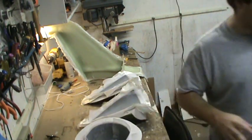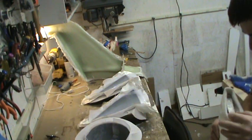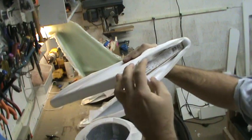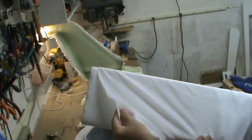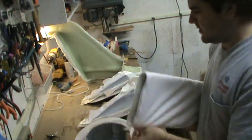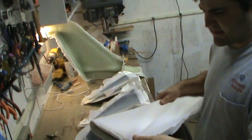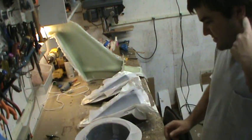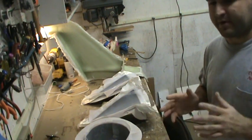This isn't really peel-ply — for those who haven't seen my fiberglass technique, it's just 100% polyester dress lining and it's static free. It's like a dollar a yard at Walmart or Joann Fabrics. The key is it needs to be this white dress liner — they've got it in yellow, red, black, and other colors, but white or yellow works best. It kind of feels like a tinted canvas, sort of. Just make sure it's dress lining or dress liner, static free, and 100% polyester — that last part is the most important.